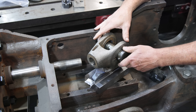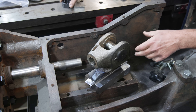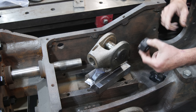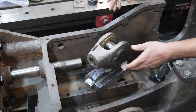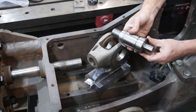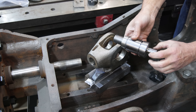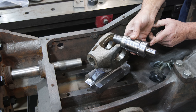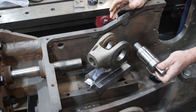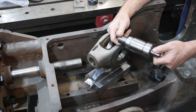The wrist pin just kind of fits up into this. There's a pin here that prevents the whole thing from rotating, and then you've got the castle nut on the end that screws on with a pin through it that keeps it from rotating off — so it all holds in place. The new ones that Dave made are right here. We did one little modification: he put a work-holding stub on the end for some further machining that still needs to be done. This will be cut off before it's all done. These are made out of low carbon steel, and according to the blueprints they are case hardened.